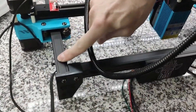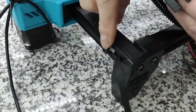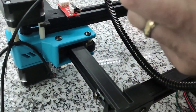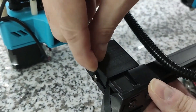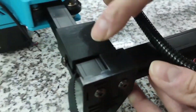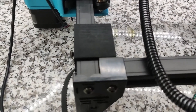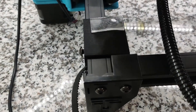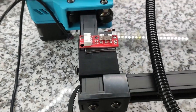We're going to install the next 3D printed part onto this rail right here. You'll notice that on this rail there's a screw, and this part was designed to have a slot — that slot is going to go into the screw. Take this piece, which slides onto the rail, and then slide it down so the 3D printed part goes into the groove where the screw is, and it slides right in nice. It's nice and snug — you don't need to screw it down, although you could if you wanted to. Take your double-sided sticky tape, stick it on the end, then take your limit switch and stick it right on top.